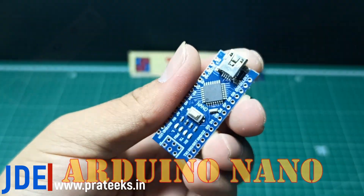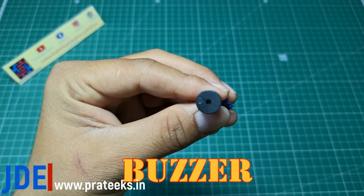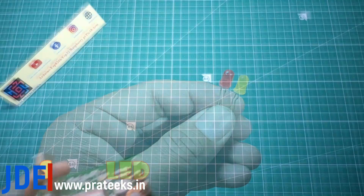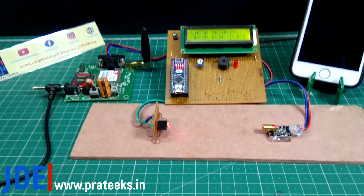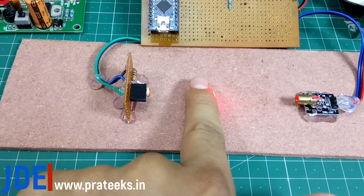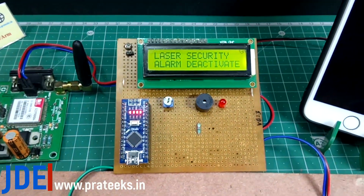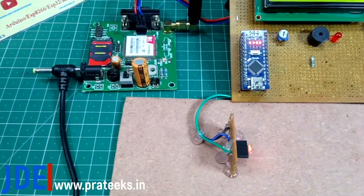The components I use: first, a microcontroller; second, a 16x2 LCD display for displaying all the data; third, a buzzer; I also use a laser and LED; and I use a SIM900A GSM module. For the hardware circuit, I use one LDR with the laser continuously providing light on top of the LDR, the 16x2 LCD display, and the SIM900A GSM module.